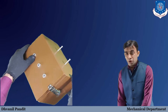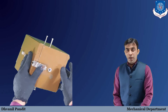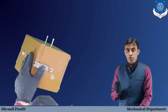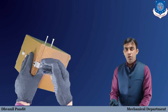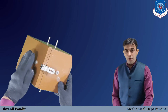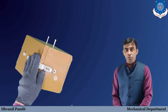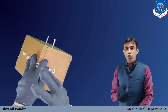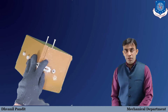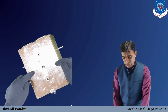We have inserted jig bushes in the top plate, also called the jig plate. We have provided jig bushes on the top side as well as on the vertical side. If we need to drill on different sides of the component, we can drill through these bushes — from the top side as well as from the vertical side — without changing the position of the component.